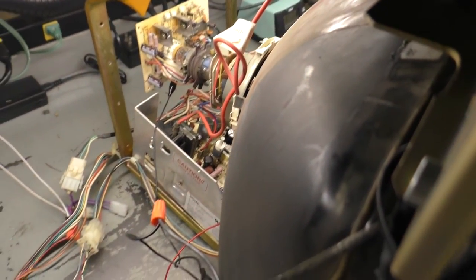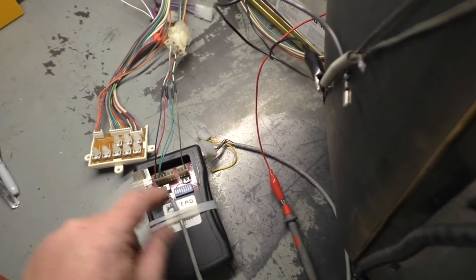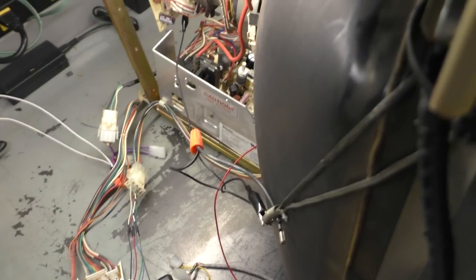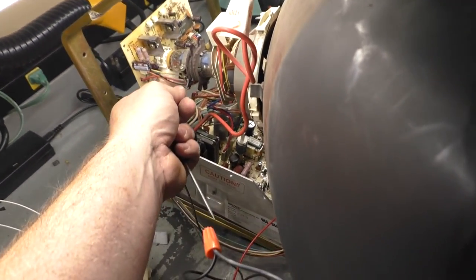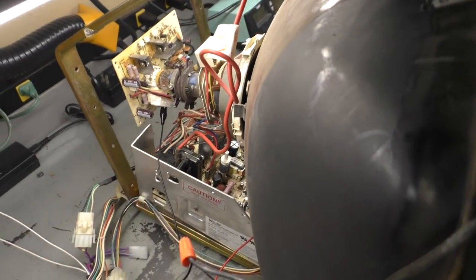All right, all hooked up with the anode, neck, yoke, ground, power, video and remote. We have our test pattern generator on. I've got the proper connections here to go to the factory connector for the video input. One thing I noticed while I was getting this all hooked up, I don't know if I go back and look at the footage, but the focus wire broke off of the neck, so I had to resolder that on there.